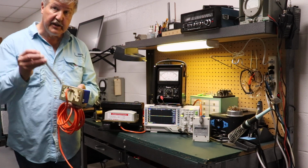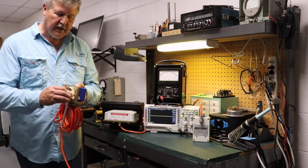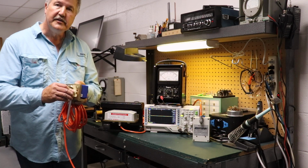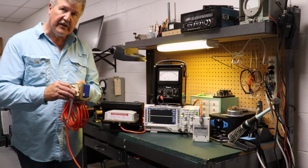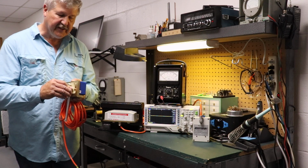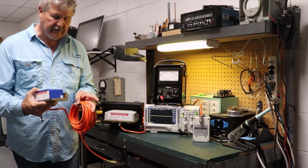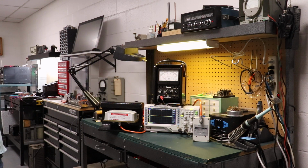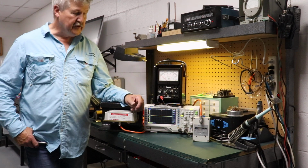So to adjust, you take the adjustment device and push it in. When you push this in against the spring and hold it, that releases the cam and allows you to adjust the sensor. And again, make sure you push up when you're adjusting it so that you don't damage the adjustment device or the wheel sensor itself. So again, very similar, but remember that they're different sensors and they have different standards in electrical behavior.